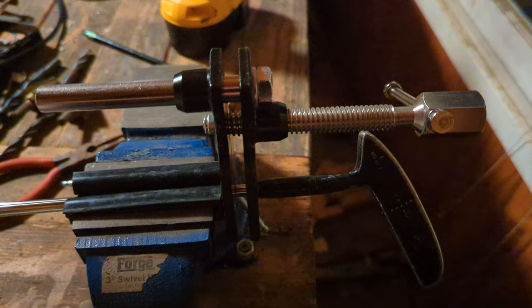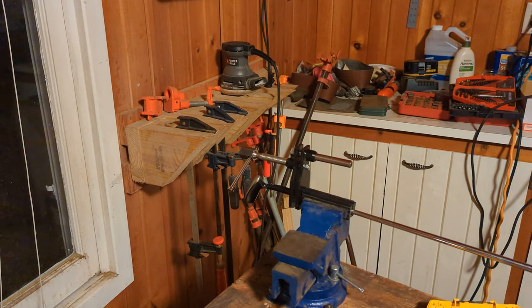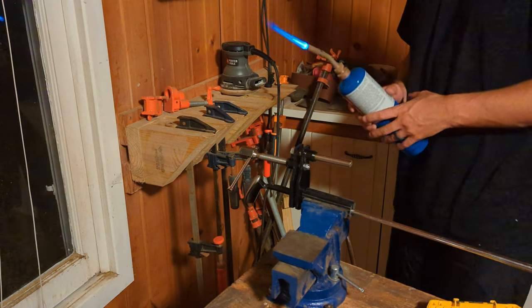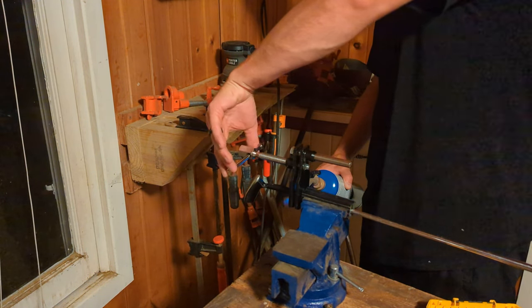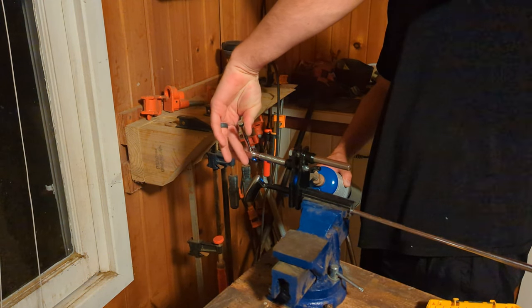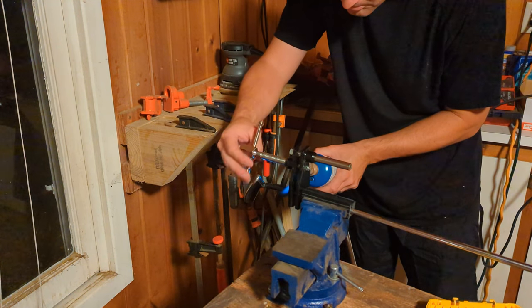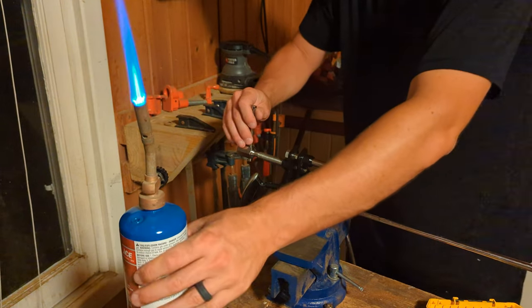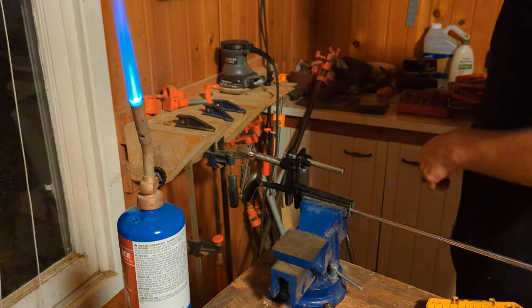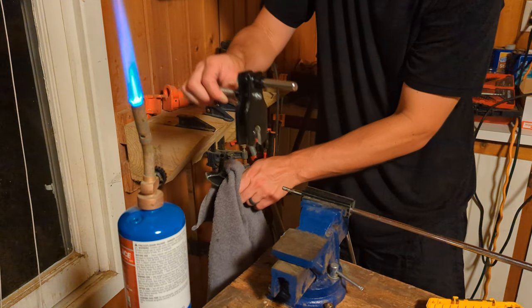For the first test I took an old putter and placed it in the clamp with the rubber attachment. The jaws pin themselves between the vise and the hosel, and as you apply heat you turn the gear puller piece at the top. I've got my blow torch — it's just the tension of the two jaws holding it in place. You hit it with heat, and as you feel the glue giving, you turn the handle, which pushes against the vise to push the club head off the shaft. The head has already come off, so I just used a towel since it's hot and removed it.